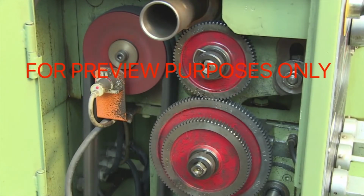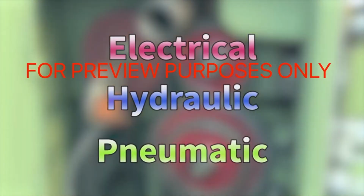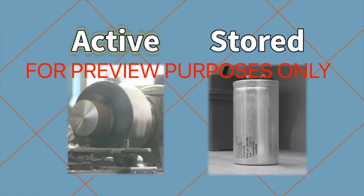The most common types of energy used to power equipment are electrical, hydraulic, and pneumatic energy. Each one of them can exist in two states, active and stored. Active means that the energy is actually being used, like electricity turning a motor. Stored means that the energy is waiting to be used, like the electric charge in a battery or capacitor.